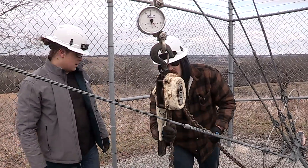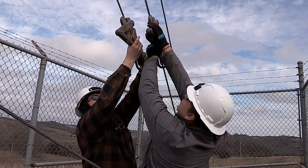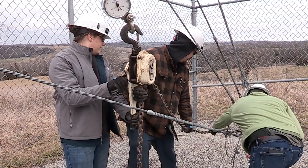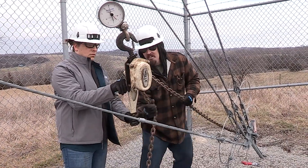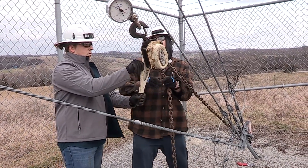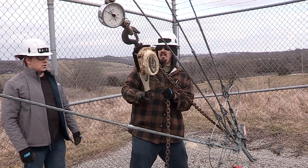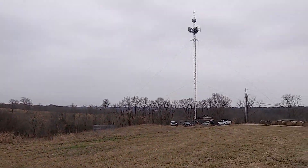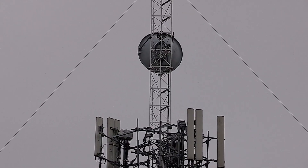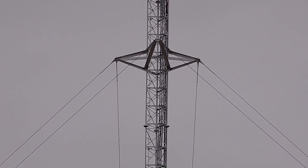The other equipment isn't much cheaper. Chain jacks, wire rope pullers, and smooth jaw wire clamps all come with a heavy price tag. A full set of properly calibrated twist plumb and tension equipment can cost a contractor between $15,000 and $25,000 depending on the setup. The larger the structure, the larger the investment in equipment might be to make sure the work is completed properly and safely.